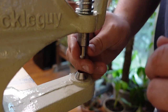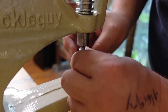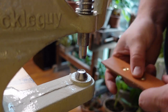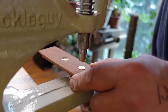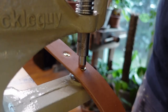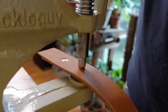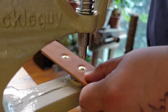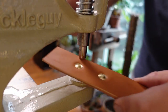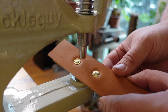You can also go a step beyond that and use a bigger die. I've only been able to do this a couple of times — it's harder to do with frequency — because it is a machine and self-centering to a degree, but this is not lab equipment. This is one size down from this setter, and in theory when I got it to work it gave a really cool ridge to the outside. Before I press down I'm going to check all the way around and see, because sometimes you just have to lean it a little. Yeah, kind of — not that great, which is why you experiment. This one looks super cool, but that one looks like you just screwed up setting the rivet.